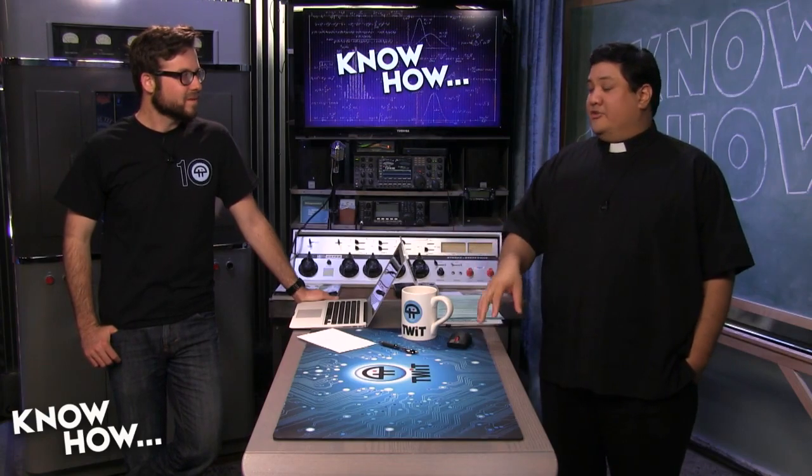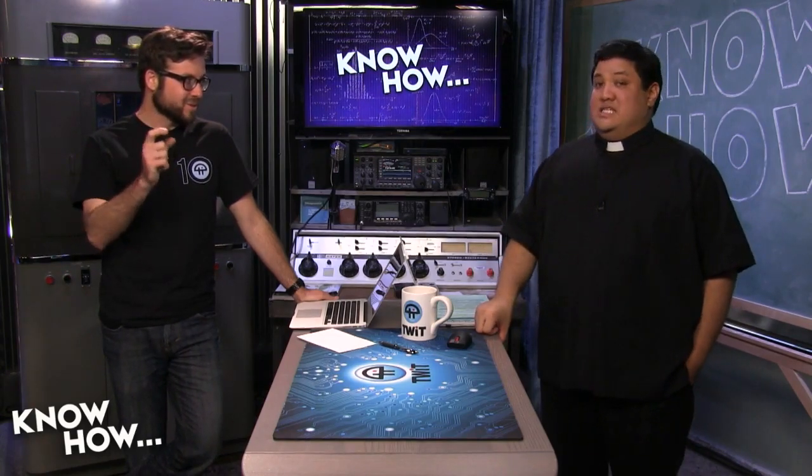So we're going to start them by showing them how to do the inexpensive mod, which is basically just buying some LED light strips, taping them to your quad, and wiring them into the power harness. His is more complicated because it's actually using an Arduino to take input from the receiver, and then it pushes out to the drivers for the LEDs. And he did have that good point where you don't put the LEDs on the edge of the props or at the arm, because that's the first thing that's going to make contact and just destroy your string of LEDs.